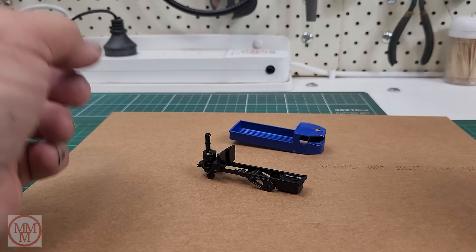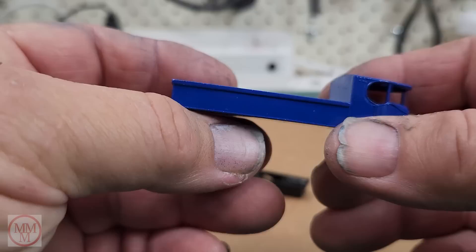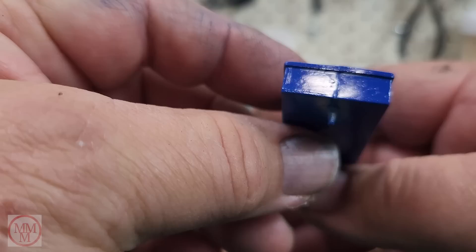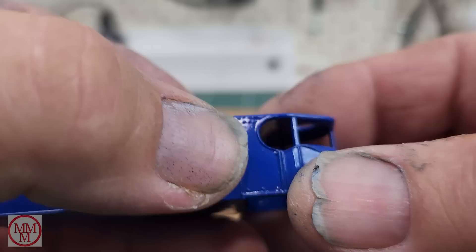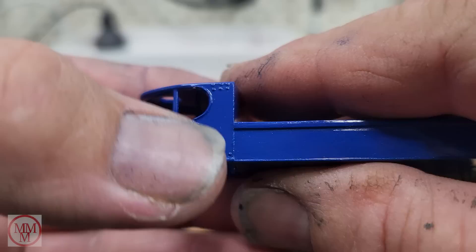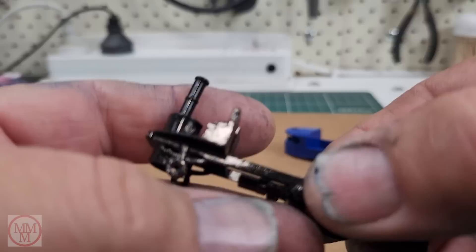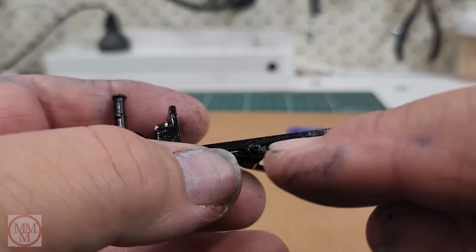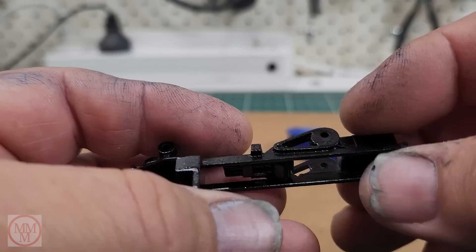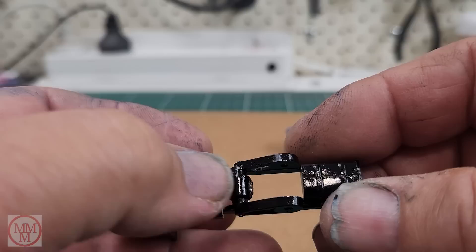Here are the various stages of this model: the original, paint stripped, the undercoating, and the topcoating. Looking at the model, it's a very rough cast by comparison to a modern casting — it has a very sandy finish to the metal, and that is reflected in the topcoat. Initially I thought there was some damage at the top of the cabin, but it turns out it's just a casting of six rivets, three of them right on the crease where the roof meets the side. The base is also a very sandy rough casting — primitive technology of the time.